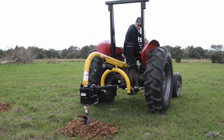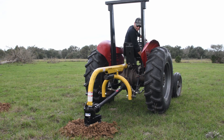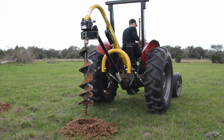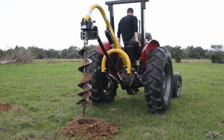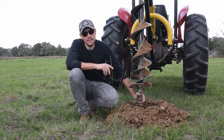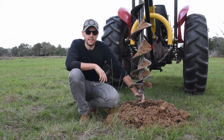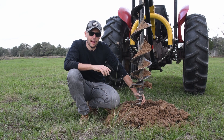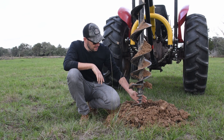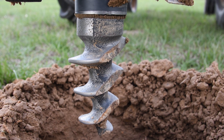You see, that's what I'm talking about — I can just pull it back up by engaging and disengaging the PTO. Yeah, all the way. There you have it. This tip number three is working really, really well. It tends to get stuck, but the good thing is I pull up the implement and at the same time engage and disengage the PTO so it can break itself loose and release. I've used this tip a few times always doing the same procedure when it gets stuck — not a single time did I need to leave the tractor. It just comes up by itself. To me, this one is also a winner when working on clay, and like the fishtail tip, it comes out clean with nothing stuck to it.